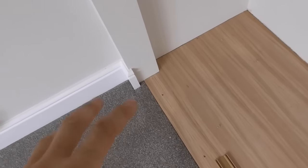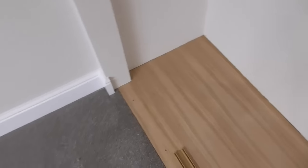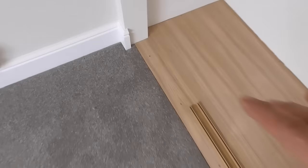Standard height on all these doors from my research is 2 metres 260 millimetres — that's the measurement from where the top rail sits down to the bottom. I've put a bit of oak-faced MDF from my local builders merchant in the bottom. What that does is allow something for the carpet to butt into, but it also allows the bottom track to fit nicely so that we don't see the edge of the timber.